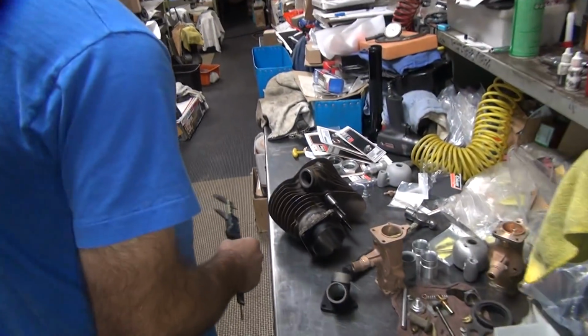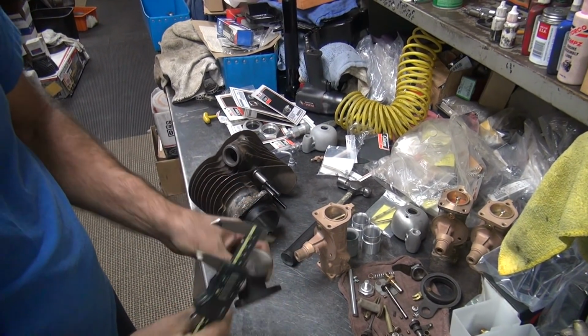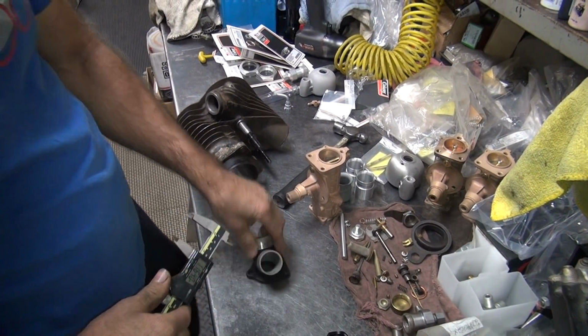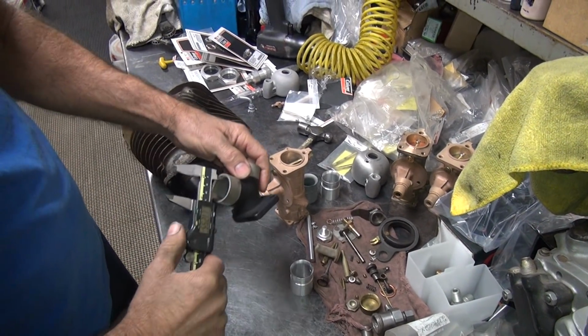Now we're on. Okay, we got this custom intake manifold all painted up, looking pretty. So now we're gonna go scratch it all up for them. So we're trying to figure out what sizes to cut this stuff out to, because it's already bigger than our big Venturi. Our big Venturi is 1 1/8. So the port's already bigger than that.